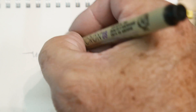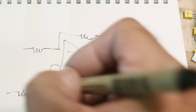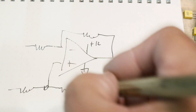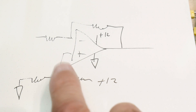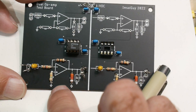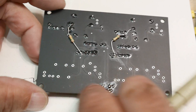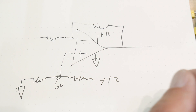Normally you'd just connect the op-amp input resistor to ground, but with a single supply you split the rail. If you have ground and plus 12V, you create a virtual ground at 6V in the center by choosing two equal resistors. On this circuit I've used 15k on each side, with one bodged onto the back, to run the board off a single rail.